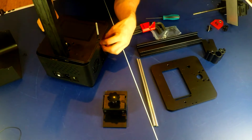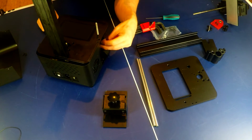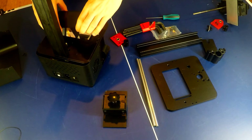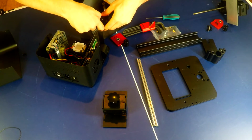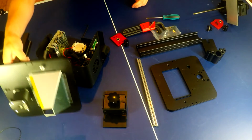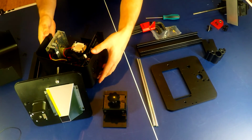The best place to disconnect the ribbon cable for the LCD is where it attaches to the board underneath the printer. You just have to give it a little bit of a jiggle and pull directly away from it, and it will satisfyingly unclick, and you'll be able to feed the ribbon cable carefully through the provided slot and set it aside. You might find there's a little bit of hot glue on your connector for the stepper motor, so you might need to cut that away before you pull it. Separate it carefully and then place the electronics we won't be modifying off to the side.